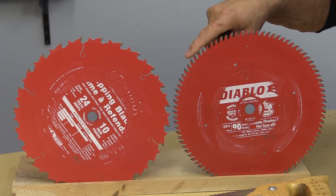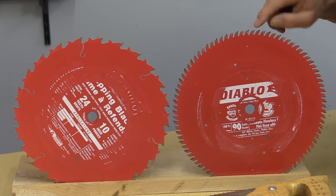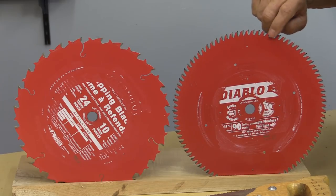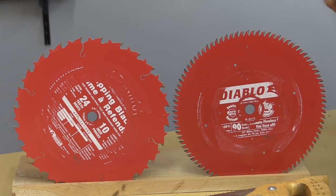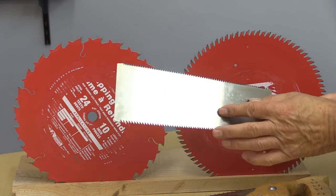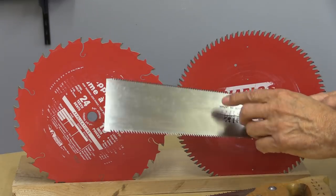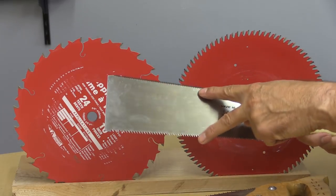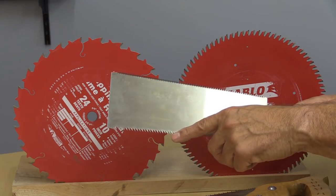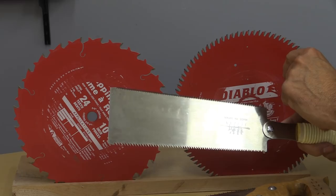It's the long side of the wood so it needs to move a lot of material out. On the other hand, here is a cross cut blade and you can see it's got much finer teeth closer together. That's because it's cutting across the grain of the wood — it's only moving out little fine bits of sawdust, so it doesn't need big gullets but it needs more teeth. Japanese pull saws are exactly the same.